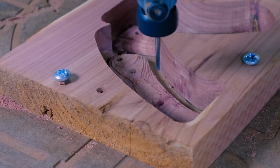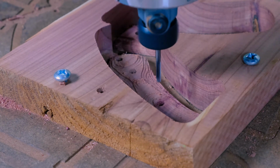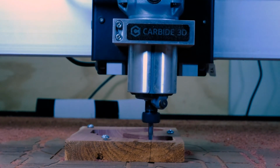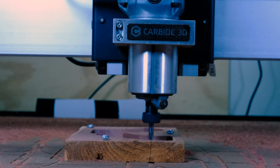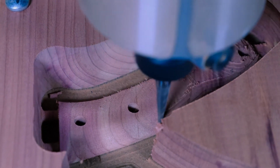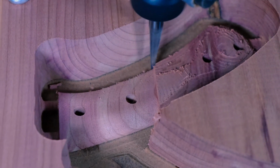We're now moving on to the second toolpath of the roughing operation, which is drilling the holes for that pocketing operation that we made earlier. Finally, we move on to the parallel finishing toolpath. You can see here that this toolpath goes back and forth very slowly along the part in very small increments. The surface finish that we achieve with this toolpath is really nice, and it makes really detailed work pretty simple to do and requires not that much finishing in further steps.